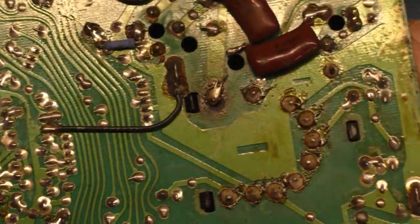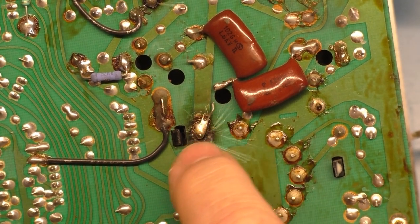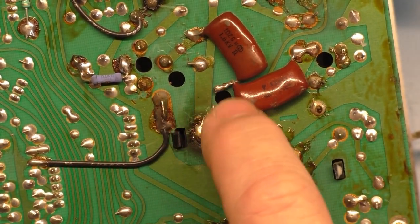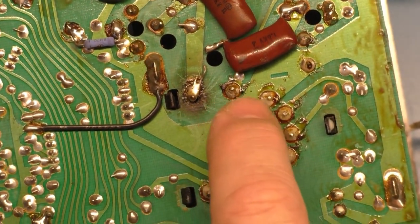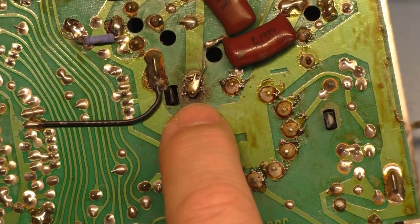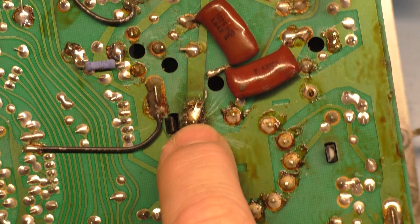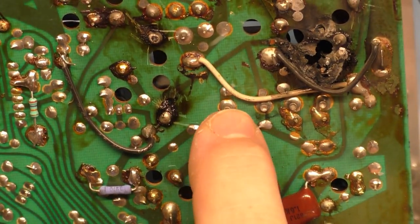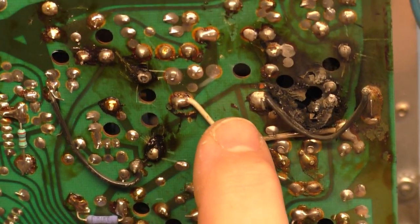And then whoever changed out the flyback damaged this pad, and they put this little metal lead around here and tried to solder this. So I think this burned up as well, because all the rest of these are good. Look at this one compared to the rest of these. I think this got very hot and burned up as well, because it's connected to the horizontal winding for the yoke, which goes across over directly.